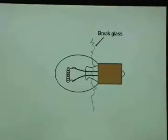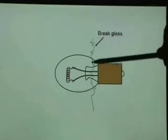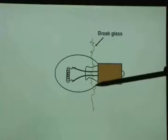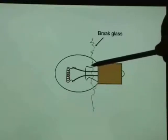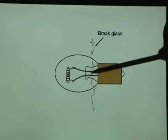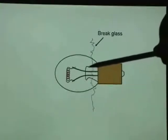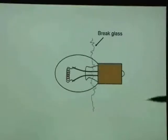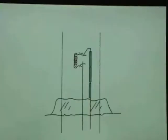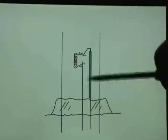Here I'll show a bit of the process I hope to use. Here's my automobile lamp and what I'm going to do is break off the glass bulb somewhere around here. Then I will also do the same here and extract the filament and its two support wires, which will still leave them secured by this little bit of glass right here so they have some rigidity.